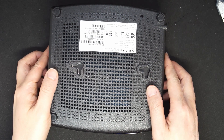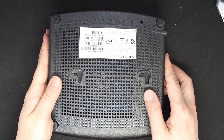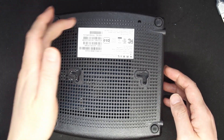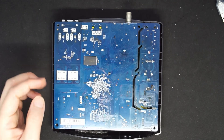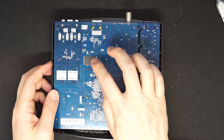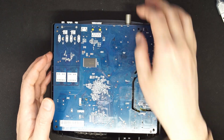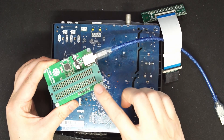This is a TM1602 modem, and this was donated to me to make a video for how to use U-Link NAND to program the chip. First you need to take off the three screws here and take off this back. This is the NAND flash, and to access this flash we can use directly the 3.3V from the U-Link NAND.